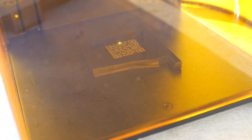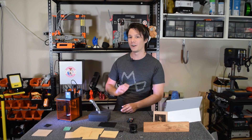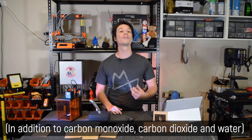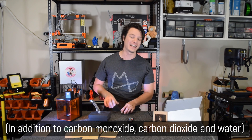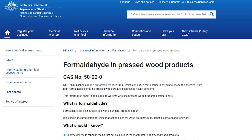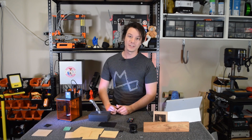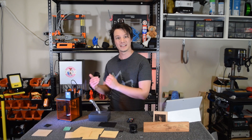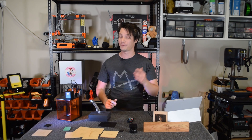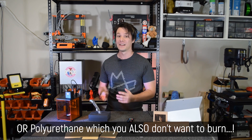Not all materials can be etched or cut. Remember, we are burning material here, not just melting it. Many common materials you'll find around the home release toxic fumes if burnt. Take PVC for example — an incredibly common plastic — it releases hydrogen chloride gas which forms hydrochloric acid on contact with water. And take MDF, an incredibly common wood product: it can also release formaldehyde gas when burnt depending on the grade of MDF, and in Australia most of it has formaldehyde in it. You will need to do serious research into materials that you can and cannot cut or engrave. For example, want to engrave leather? That's fine — but are you sure it's real leather? Because fake leather or pleather is actually PVC plastic, the super nasty acid gas one. Please do your research.